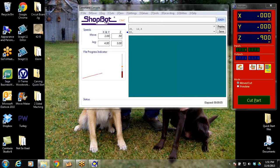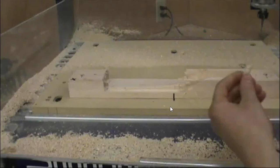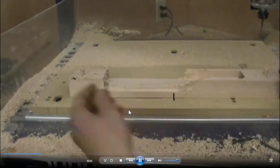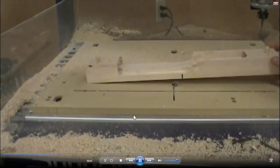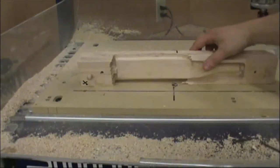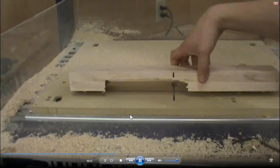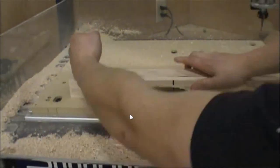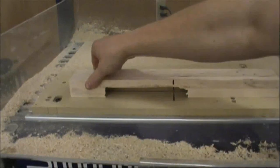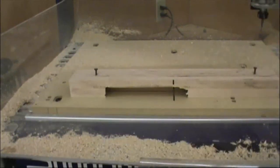and once the screws are out, I've done nothing but flip it over. I go ahead and put a pin in there, and I put a pin in that side. Move it out of the way, and all you're doing is flipping it over from face to face. There's those pins in the table. So now that center line exactly lines up with the center of those pins, and you have just successfully flipped this thing 100% over on itself.